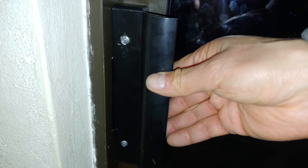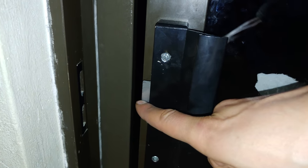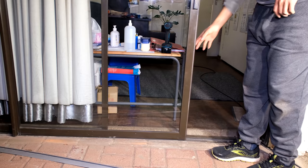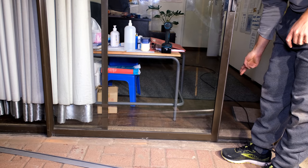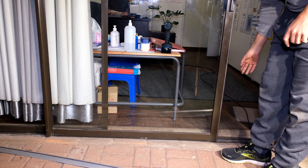Make sure that the door still locks and that it's not catching — you've got to make sure the latch aligns into the striker. If you make the wheels too high it may no longer align. Open the sliding door all the way from left to right, check that there is no scratching or scraping, and then do a final check to see that the clearance by the wheels is correct. Sometimes when people install the sliding door the track is not completely horizontal, and you may need to make one wheel lower or higher than the other.